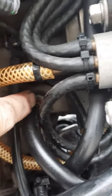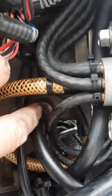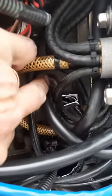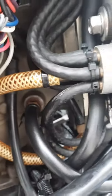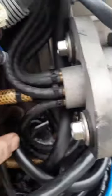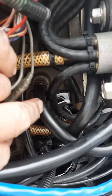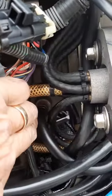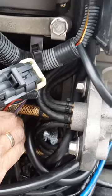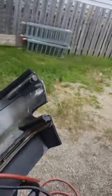All this mess of wiring right in here — that comes off the crankcase, that's the line I took off over there. There is a check valve in here, in this fitting. I went to take the hose off and this fitting was loose — I don't know how long it's been like that, whether it backed out or was like that from the factory. There is some kind of thread locker on it, but it was really loose, and the hose was really easy to pull off even with the zip tie on it.